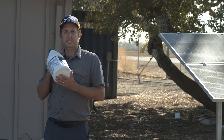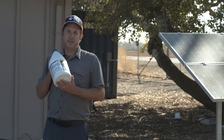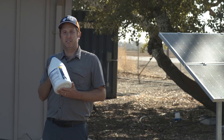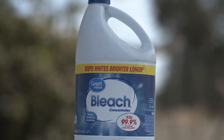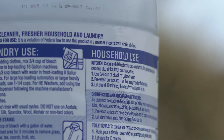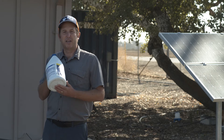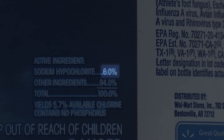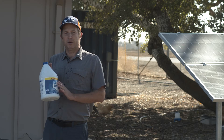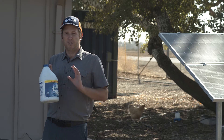For step one we're going to need to purchase some bleach. We're using bleach today because it's easy to acquire and very easy to pour down the well. They also make disinfecting pellets for wells, but they're a little harder to find and usually need to be ordered. They contain the same substance — sodium hypochlorite — which does the disinfecting. Household bleach comes between six percent and eight and a half percent concentration. Make sure you get an unscented brand so there's no perfume to flavor your water. An unscented one will be easy to flush from your system so you don't have any residue.